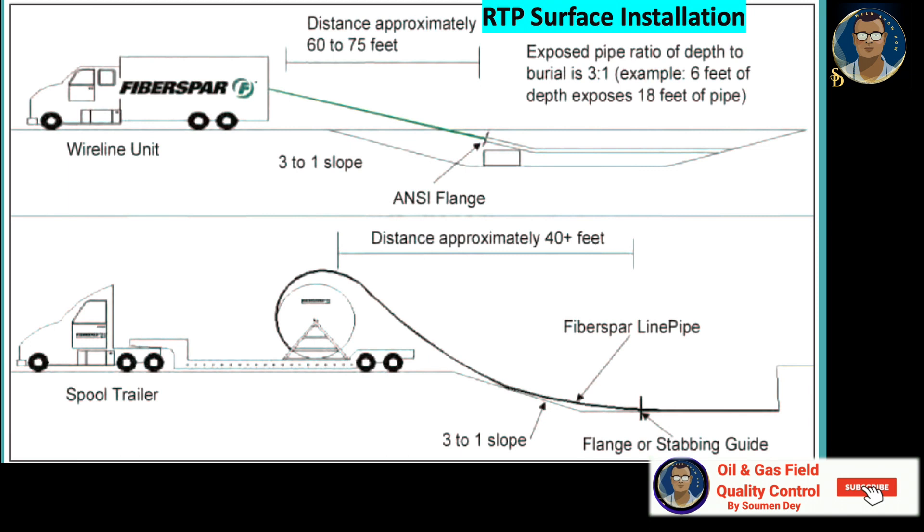Vehicles should not be driven over RTP, so crossing points may have to be provided. Since the pipe will not be restrained during hydro testing, it can shrink in length during the test. Care should be taken to ensure that the pipe cannot move and tighten against pinch or kink points. RTP engineers can advise on the amount of expected shrinkage and how to make provision for it. Caution: it can be difficult to move the unrestrained pipe around planned bends in the right of way, and pipe rollers and anchor points must be used to route the pipe. RTP field supervisors should be consulted in advance for advice on the route and equipment required if a surface installation is planned.